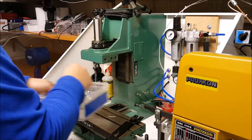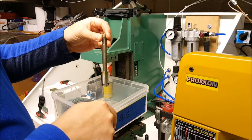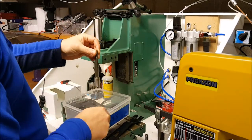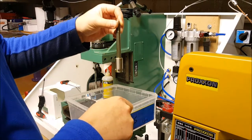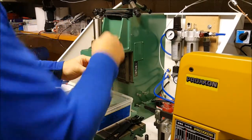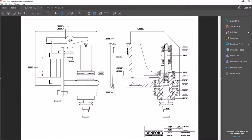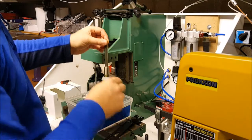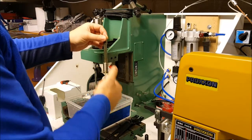What we have is one of these — I've got it in a pot because there are ball bearings in it. What happens is: as this is pulled up inside of here, there's a taper — I'll show you on the drawing. That's in this region here on the drawing. As it goes up, these balls are pushed in, and as they're pushed in, they grab around the back of that shoulder there and hold it in.